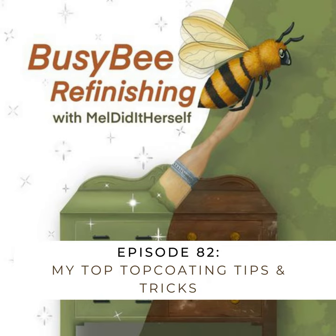There are a lot of different recommendations about what tool is best to use. A lot of people like a paintbrush, which I've done in the past. I'll use a brush for any small crevices or details that a roller wouldn't reach, and then use a roller for the larger, flatter spots. In terms of paintbrushes, I like one that doesn't hold a whole lot of product because I prefer to do multiple thin layers and build up over time rather than trying to get a thick finish from the get-go — that prevents drips or pooling.